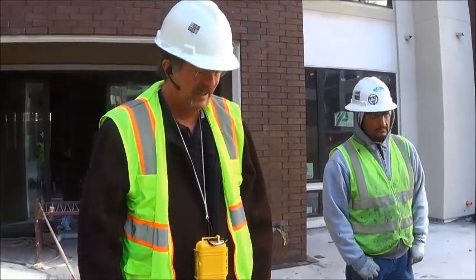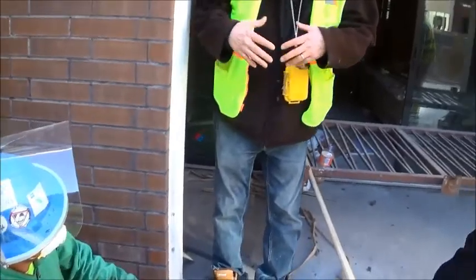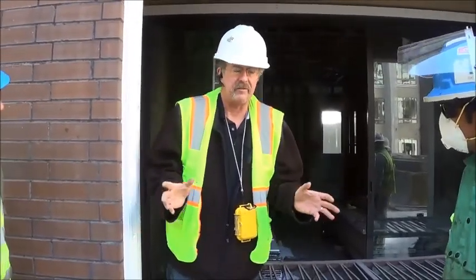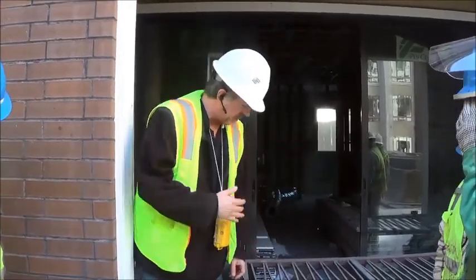That is always the preference. So does this job call for a flex flash? So a neoprene sheet? Neoprene sheet, yeah. That neoprene sheet from Hydrotech, because we're all born and bred Hydrotech. Years back. Same. And all the hot rubber, I've used them all. So the Flex Flash UN, Tremco's elastomeric sheet, all those sheets are a coated sheet. They're all the same now. There's no difference. And the details are the same. But you gotta learn some tricks.